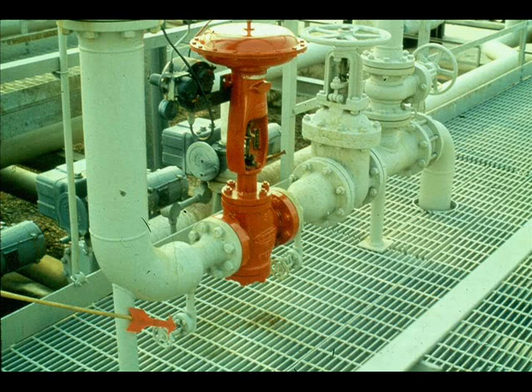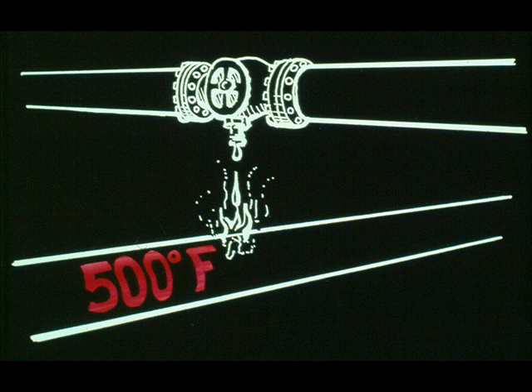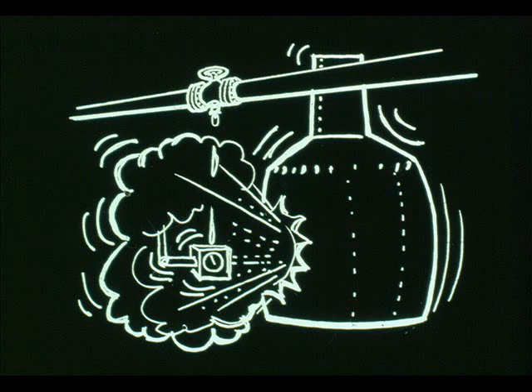The drain is a very important safety item. It provides for depressuring of the valve for maintenance or removal. API RP-550 mentions that care should be taken so the drain does not release or splash a flammable material on hot lines and cause a fire. Make sure that the drain on a gas regulator is far enough away from any ignition sources so that ignition will not occur.